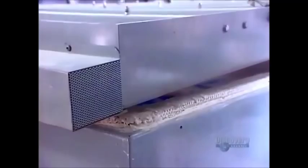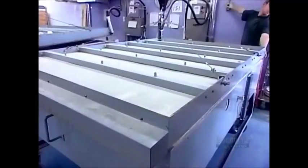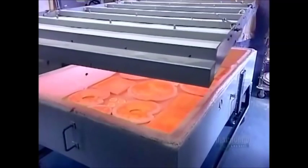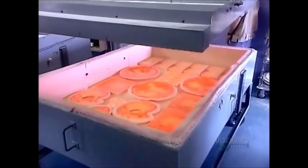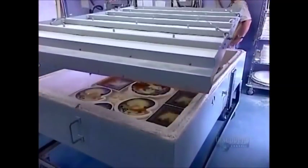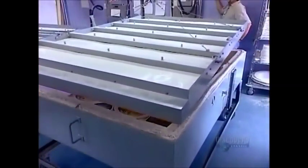It takes an hour and a half for the kiln temperature to climb to a scorching 843 degrees Celsius. At peak temperature, they open up briefly to make sure everything is progressing well. The glass at this phase should be the consistency of maple taffy and glowing bright red — if it is, they close the kiln and begin the cooling phase.